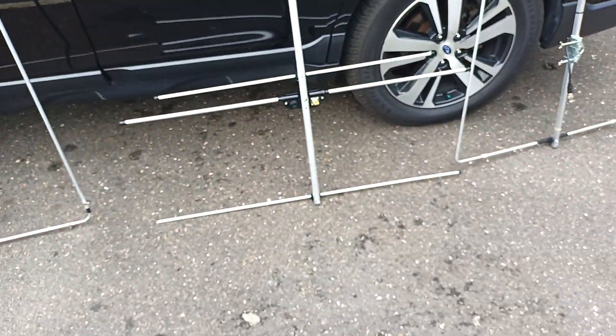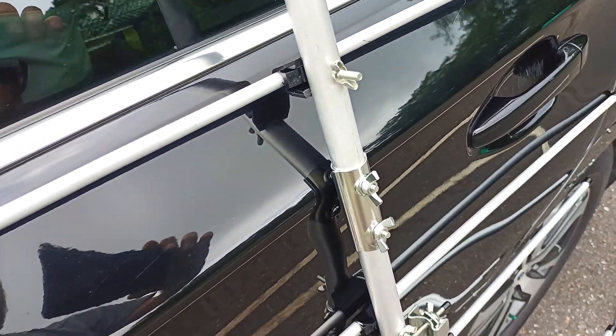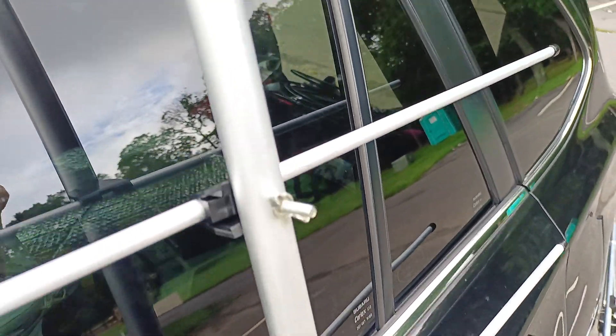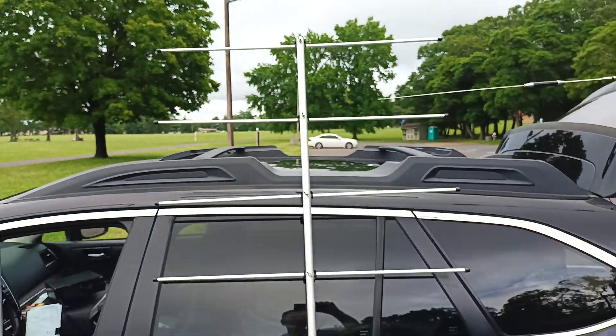This is the Diamond antenna. This is a 10-element 2-meter antenna. You can see how the boom mounts together just with two wing nuts, which makes it perfect for rover operation. And then each element basically has a wing nut on it as well, so it makes for a very quick and portable setup.